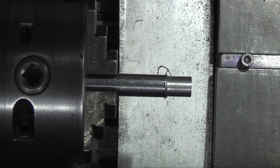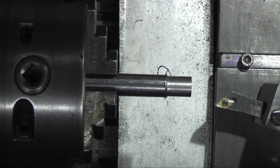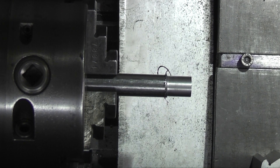What I'm going to do is machine this bar using the same speed and the same feed rate for cutting. I think on this at the moment it's set to 0.2 millimetre per rev which is about 8 thou. So using the same feed rate and the same speed, all I will do is change the tools. I'll use this one which I used last week which is the insert, and then I've found an old tool that I had — this one which is high speed steel — so we'll compare the difference between an insert and a high speed steel tool.